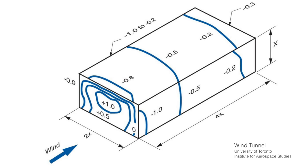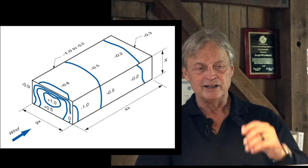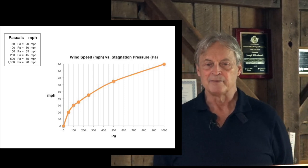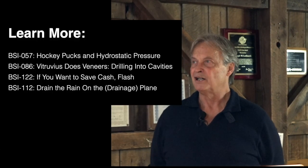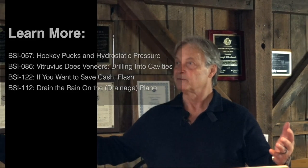This is from a wind tunnel at my alma mater. I graduated as an undergrad at the University of Toronto. We had the Institute for Aerospace Studies, and they ended up building mock-up houses and walls and blowing air against them — partly because a politician in the 50s canceled the Avro Arrow project. Anyway, these are the pressures for wind. You can figure out what the pressure in pascals is for miles per hour. One inch of water is 250 pascals, and 250 pascals is a 45 mile-per-hour wind. I can get 80 and 90 mile-per-hour equivalent forces simply if I don't drain the water. That's huge.